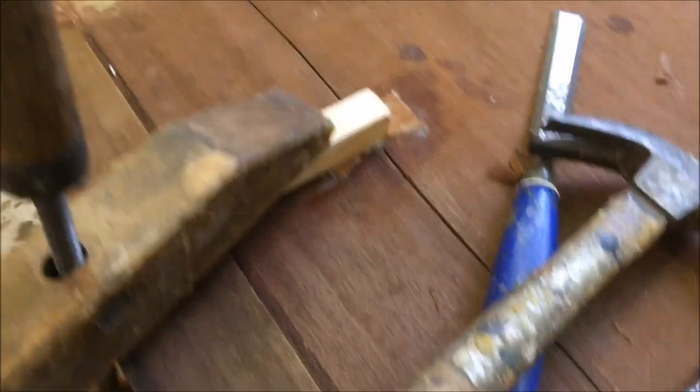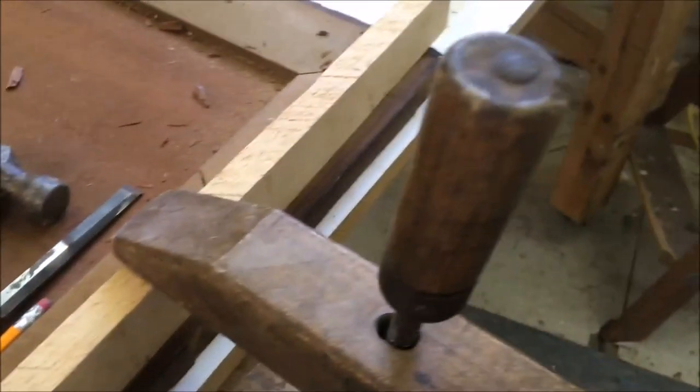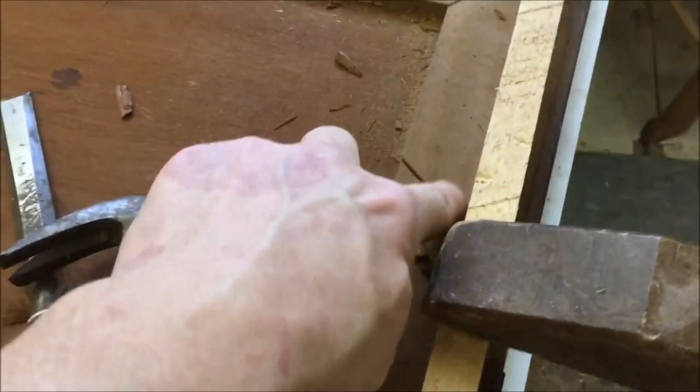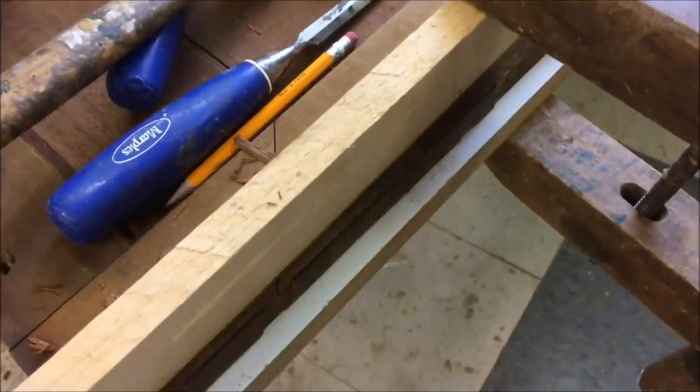All right, here we are. We got two butterflies in across each crack. And once again, it's clamped to a piece of melamine. I've got the ends clamped flat. If you remember, we relieved these cuts and then allowed the top to go flat.